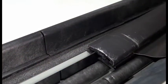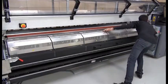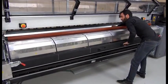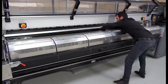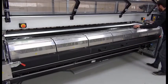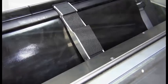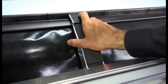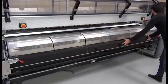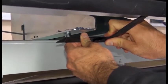The back side should be face up. Unlock the curing module latches and open the curing module. Drop the protector through the gap under the curing module. Insert the barriers at the edges of the protector tab. For 126 inch or 3.2 meter substrates, the barriers are not required. Close the curing module and lock the latches. Hook the clips from the protector to the bottom part of the printer.